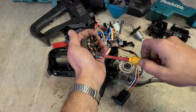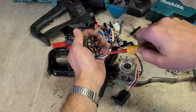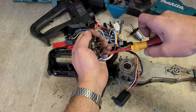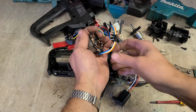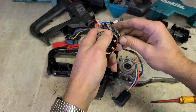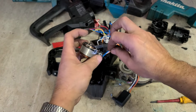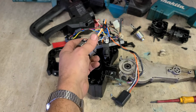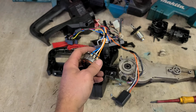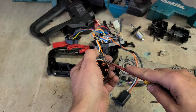These three screws to take out then. Just hold the heavier leads in and actually take the current for running the motor. Hoping these are on a little block. Yeah. Actually all together in this little plastic block, so there's no mixing up the colours. Sometimes you take these apart, they could be sitting a few weeks before the part comes in. You can forget which way the wires go.